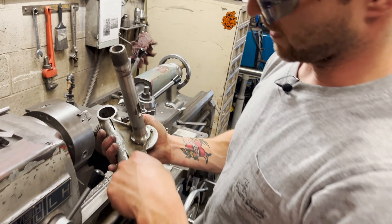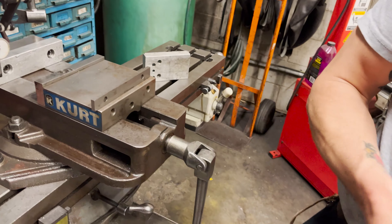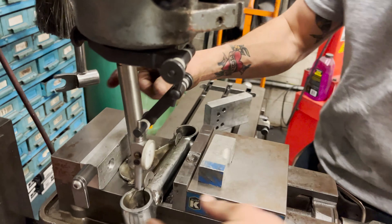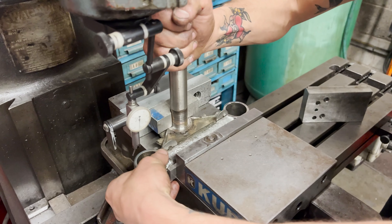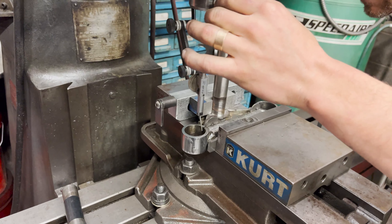Next we've got to bore the diameter of both of these out. We pulled the pinch bolts out and added some shims so that when we clamp this in the mill it doesn't actually pinch the tree. We've machined a one-inch groove so that mates there, and that'll be used to clamp against here. Then we're just going to use this parallel which sits perfectly flush on these flats — like that. I've got to make sure I leave at least one side overhanging the vise because when we use the boring bar, obviously we don't want it to bottom out. Got the parallel in place, got the aluminum piece we made in place, we're overhanging and I'm flat. Now we're going to indicate this hole in to read zero all the way around as far as diameter, and also read zero up and down.